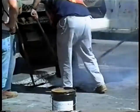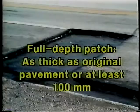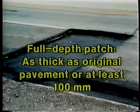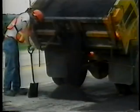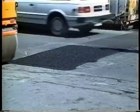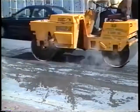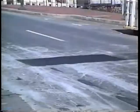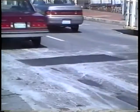Once it's cured, the concrete should be covered with hot mix to form an asphalt cap. The asphalt should have a uniform thickness of at least 50 millimeters. When a full depth asphalt patch is constructed without a concrete base, it should be at least as thick as the original pavement or at least 100 millimeters in any case. Also, the mix should be placed and compacted in separate uniform lifts. Mixed temperature requirements should be complied with whether the asphalt patch is full depth or cap only. Proper compaction procedures should likewise be observed in either case. The patch edges should be compacted first, then the entire patch should be rolled in both directions. The finished patch surface should be smooth and conformed to the surrounding pavement surface — no bump, dip, or other noticeable difference in ride quality.